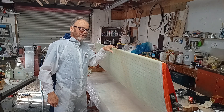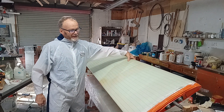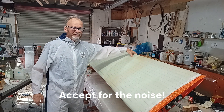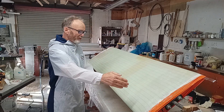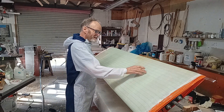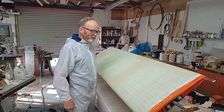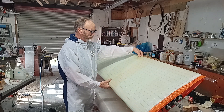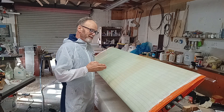After quite a few hours I've got about half the glass on as intended. The rotating device is working really well — it just makes all the difference. I've got a lot more glass down on the bottom side where it supports the daggerboard, a bit of extra glass in the area where the bolts are going to go through, some Kevlar down the leading and trailing edge, and a band around where the top of the daggerboard will be sitting when it's in its down position.